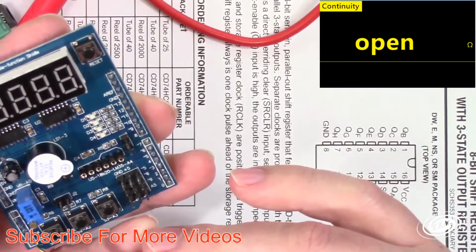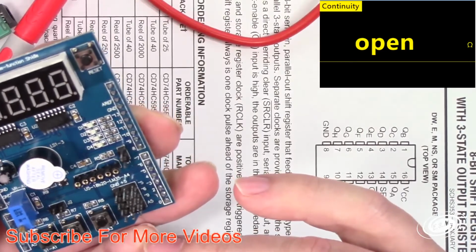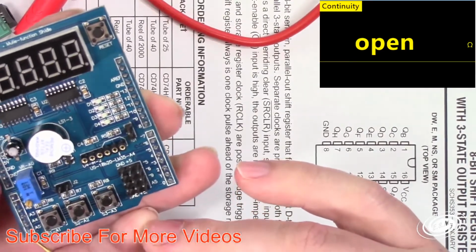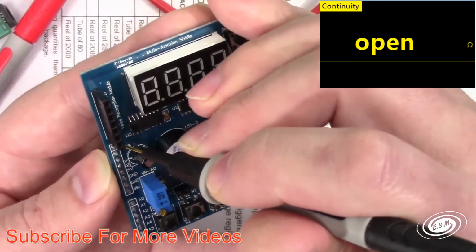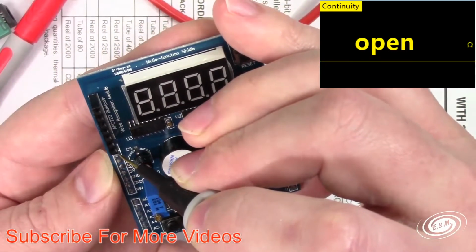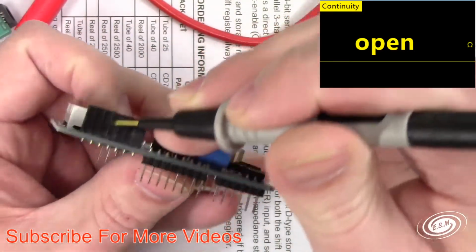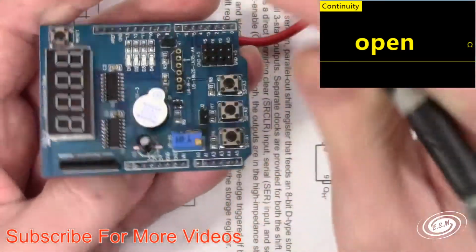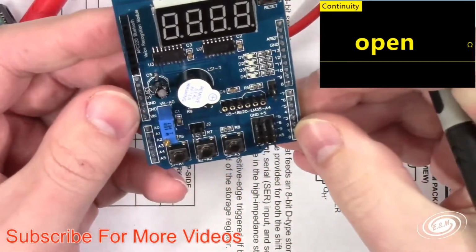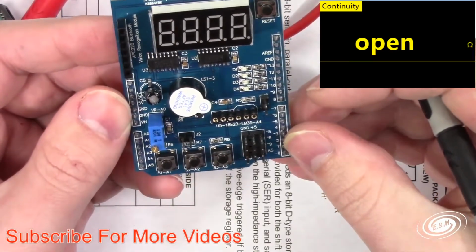It goes to what I thought appeared to be A5. But it appears to loop around, go up, and go over, and plug in up here under this solder mask here. It plugs into there. It has a long way to run that pin 0 track. I think they could have punched through the board and came up somewhere else.